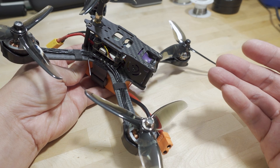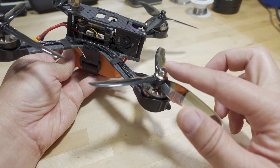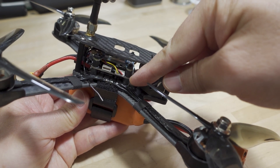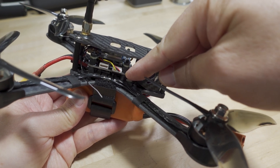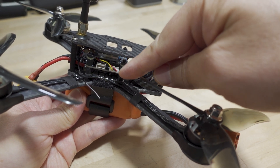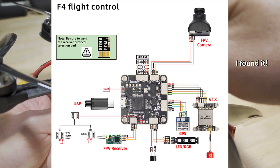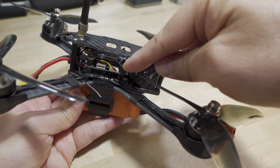It's an analog drone - I don't believe they make anything DJI anyway. It has 2206 motors, I believe 2300kV, and a pretty standard 30x30 stack. In this case it's a 50 amp 4-in-1 ESC - it's BLHELI_S, not BLHELI_32 - and an F405 flight controller. Some of them have plugs. There's no wiring diagram for this flight controller anywhere I could find, though they might be selling this part separately, so check that listing.